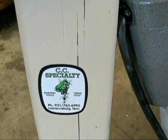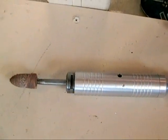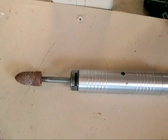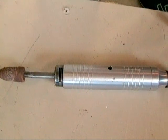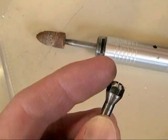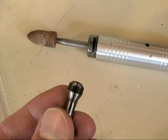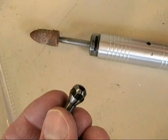When working in aluminum with a straight hand piece, you can put a little more pressure on it. But when working with a 1MC or any right angle — the 182 or any of our right angles — don't use pressure. You can split one of these little collets really easily; if you put too much pressure on them, one of these little ears can come off. There's no reason to do it. If you're using pressure, you're probably doing it wrong anyway. Let the RPM and the cutting surface of the carbide burr do all the work.